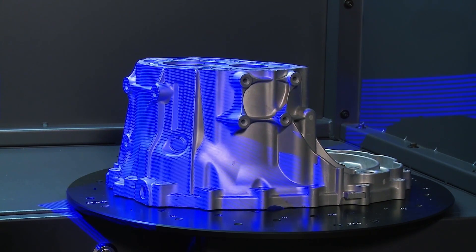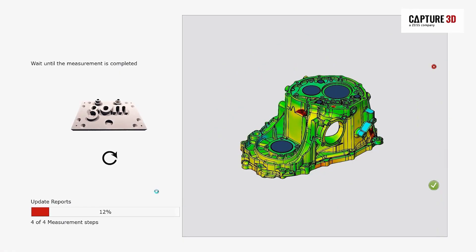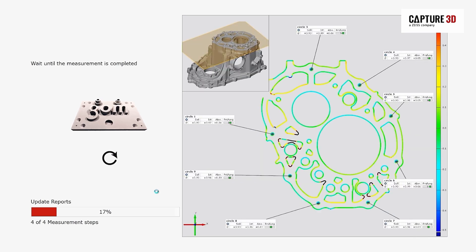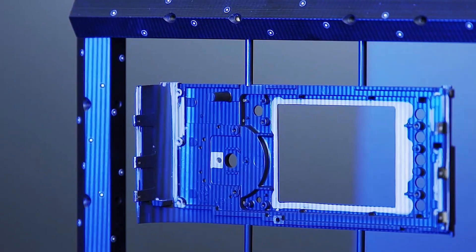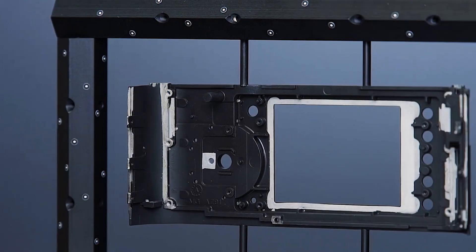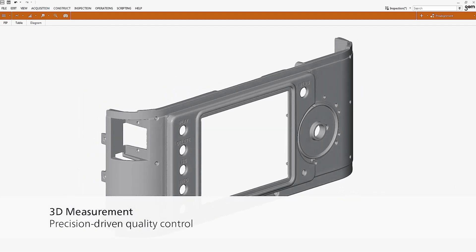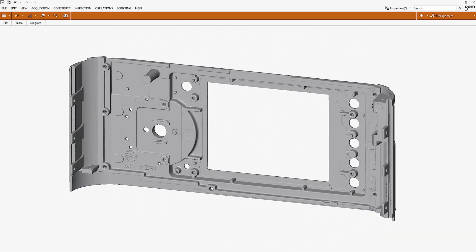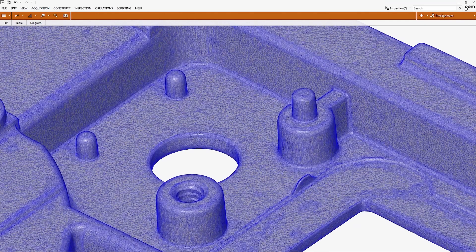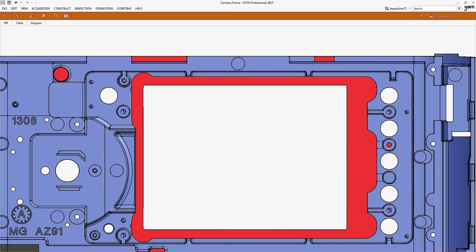This combination is an optimal solution for efficiently digitizing and inspecting small parts in complex geometries up to 20 inches in size and weighing under 220 pounds. The part shown here can be completely digitized top and bottom in less than 5 minutes. This ultra-high-resolution technology makes the Series 4 a favorite whether a customer is doing injection-molded or die-cast components. It's also a favorite for smaller tooling molds and applications involving stamping or bending.